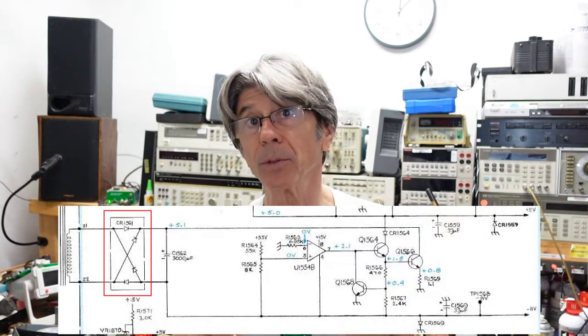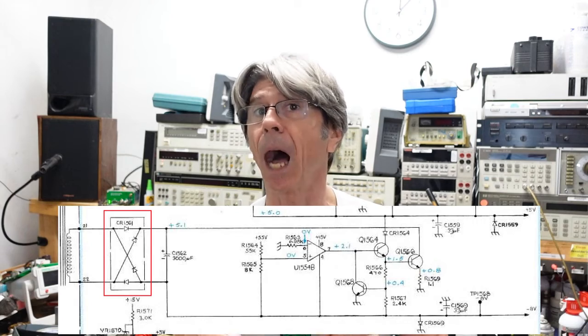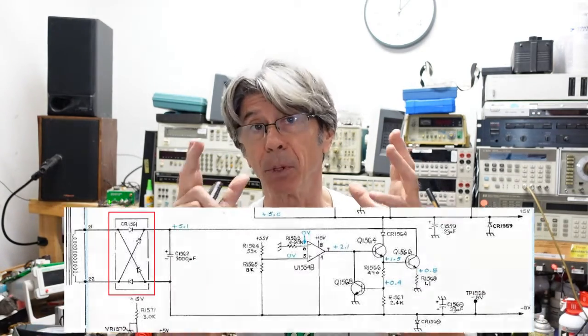In order to get to it, I thought I had to pull the circuit board, and we're going to look at that — you'll see why that's such a nightmare scenario. But subscriber Mark Zacharias gave me a valuable tip. He said just twist them until they snap off and pull the leads out. I did what he said and it was far easier. There's a real risk of causing damage to the circuit board if you try to remove it.